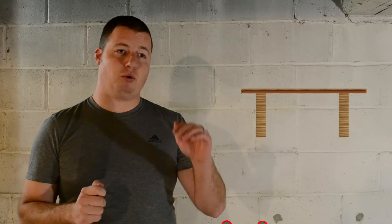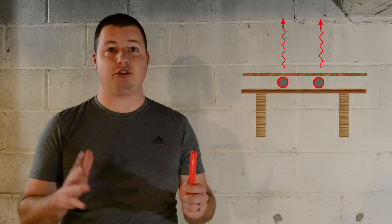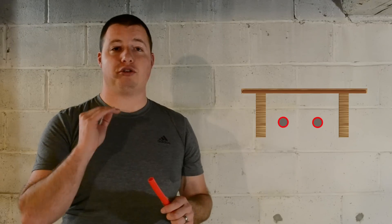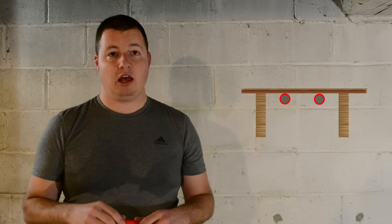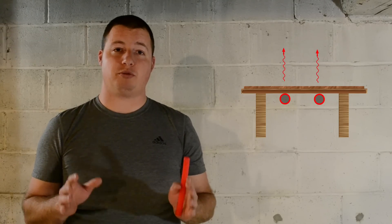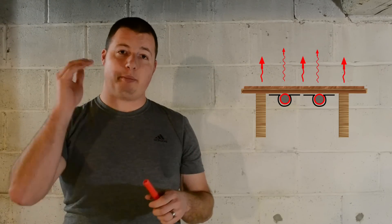The first being a new home build, where you run your PEX tubing through in between your subfloor and your flooring. This is the most efficient way because you're only going through that layer of laminate, hardwood, or carpet to get into your rooms. For people like me who already have their home with baseboard hot water heat or forced air, you want to do a retrofit — that's where you run your PEX tubing underneath your subfloor in between your joist bays. This is less efficient, but we're going to use aluminum heat transfer plates that fit around our PEX tubing to help transmit the heat out and up into our rooms.